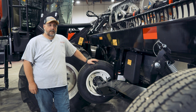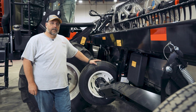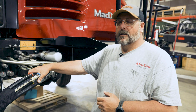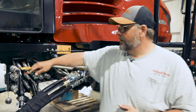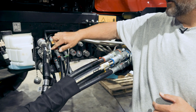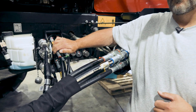Moving around to the right-hand side of the header, this one is equipped with the easy move transport — the exact same system that we use on the FD2 flex header. These wheels can be used as stabilizer wheels or as transport wheels. Your hydraulic hookup to your windrower is pretty much identical to the previous gen D1 XL system, with two multi-couplers: one for your knife and draper, the other for your reel position controls. You'll also notice two electrical connectors — this is something new for the D2. Previously we've only used the single one, and this extra one is now being incorporated for this header.